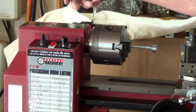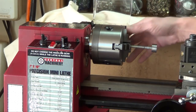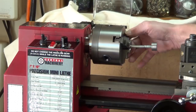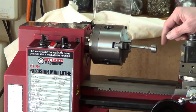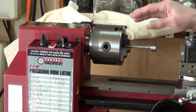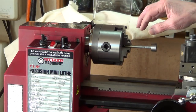So I turn it to a specific notch here and just observe what the vibrations felt like for now. Take it over to the device, you can see it's off. So I just whack it with a hammer, put a mark on it. Now I can see where, by moving it around, the vibrations get worse or better, just shifting it around.